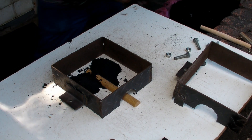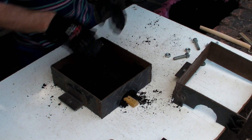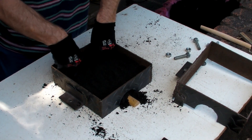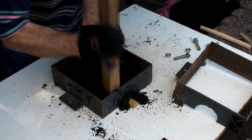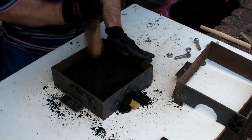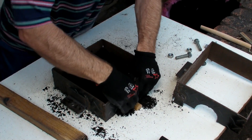I was melting stuff that had a lot of impurities in it. Copper's an interesting one — the melting point of the oxide is very, very close to the melting point of the metal. The problem with that is you end up with oxides and metal mixed at the melting point. When you pour it and it starts cooling down, you pour that oxide in with the gas, which makes gas bubbles. So I've come up with my own little reduction mixture to stop that from happening. I know it works, I've used it before, but I was lazy this last time.